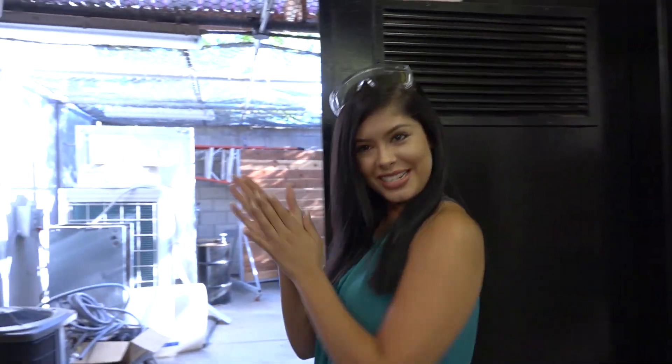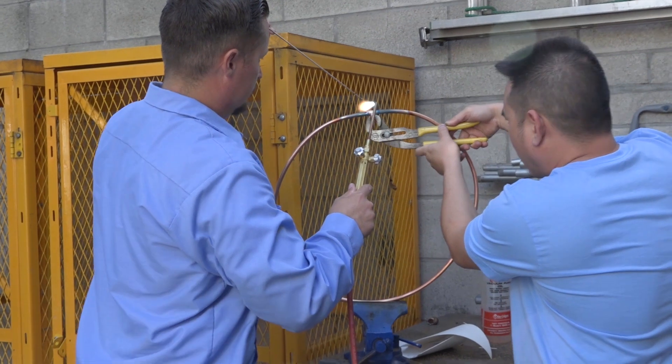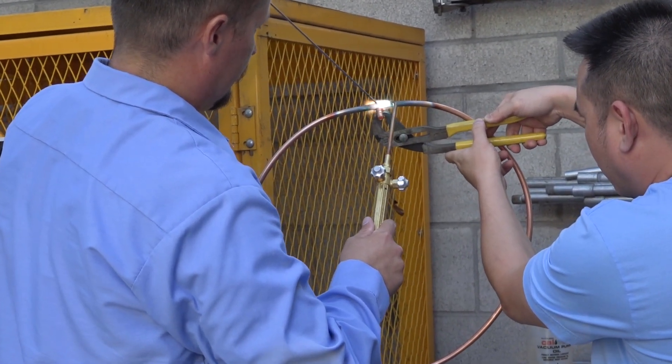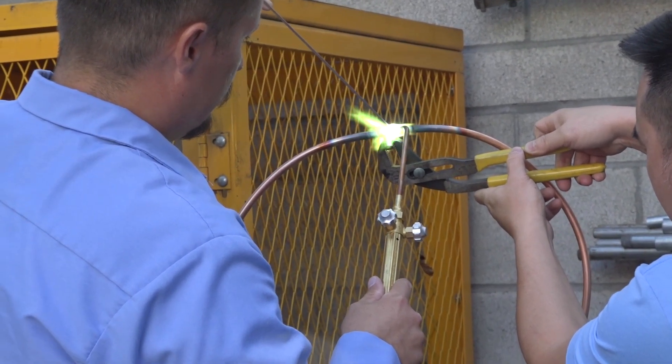Can you take me to go check out the students working? I want to see exactly what they're getting into. Maybe I'll get my hands on something too. So, explain to me a little bit more about what they're doing over there. Over here, what they're doing is they're working with our oxygen acetylene torch system. And what they are doing is actually brazing. That's a form of welding that we utilize for sealing our system so we can keep the Freon trapped inside.